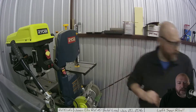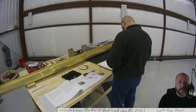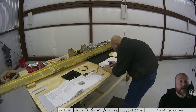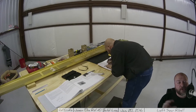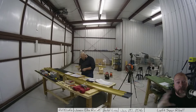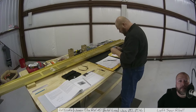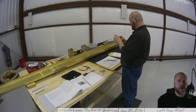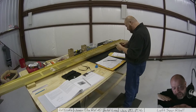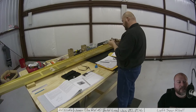Here I'm using my Ryobi bandsaw and my Ryobi grinder. I've got to get a new blade for my bandsaw because at this point the blade's really dull and I'm just burning my way through the aluminum — and the aluminum gets hot, as aluminum is wont to do. On the grinder, normally when you buy a 6-inch grinder it comes with two stone wheels. I replaced both of those with 6-inch Scotch-Brite wheels, and I took the housing off the right side so you can move pieces around and maneuver them — the housing really gets in the way because it only gives you a little gap.